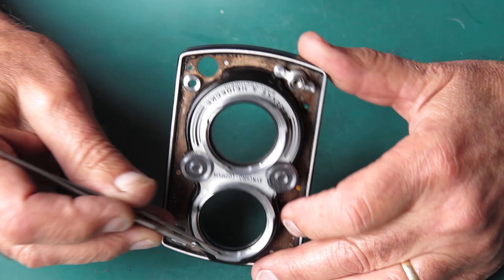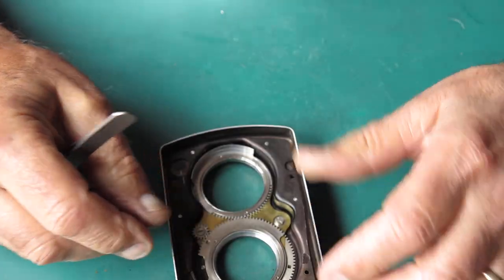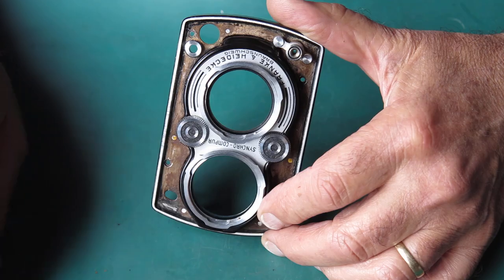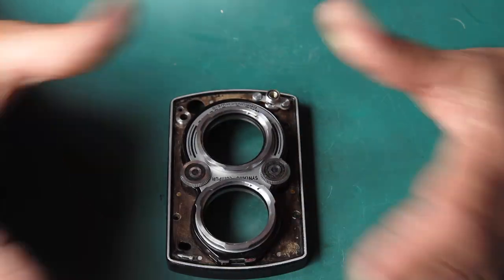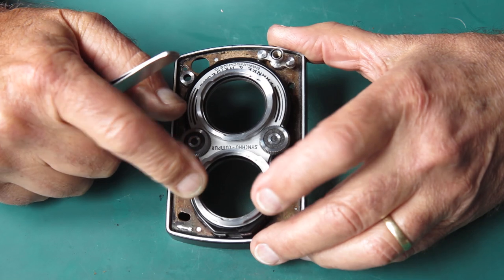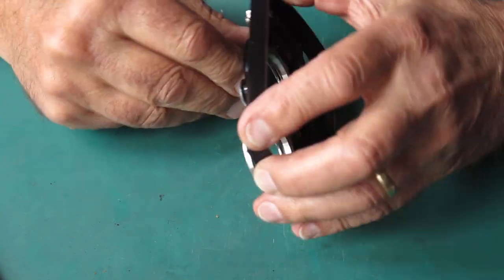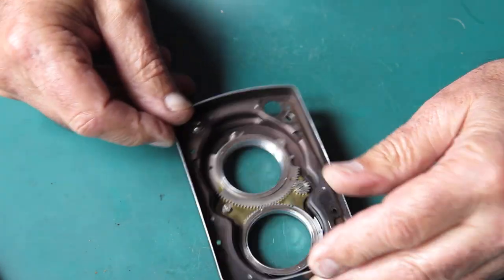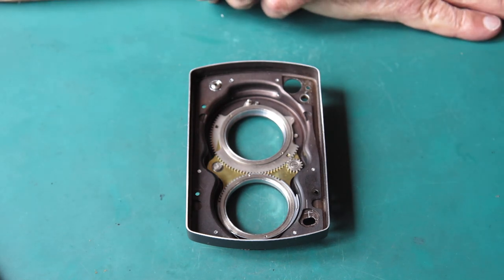There are three tiny little cup-shaped objects and three tiny little corresponding springs. These provide some friction — a kind of controlled click-stop for the filters when you bayonet them on. That friction stops them rattling loose. They're three tiny little cup-shaped objects made out of metal going into holes in this piece, with three tiny little springs — same at the top, same at the bottom. They go in exactly the same positions relative to each other and have a tiny locating pin which locates them to the front plate. They'll only go on in one direction, one position. Very tedious putting this together — you could spend half a day at it.